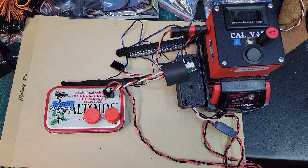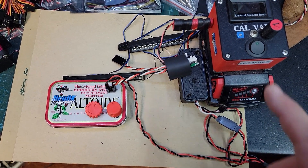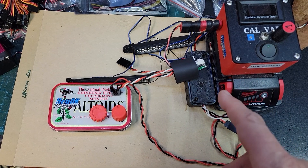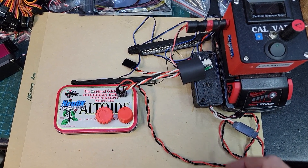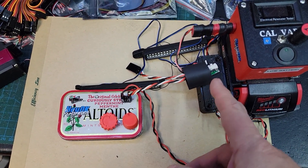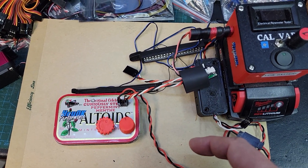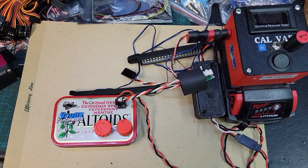Here's the new light controller, mostly working I think. This is a power supply, so it can be anything you want — it's got to be more than 12 volts. There's a regulator inside the circuit that I haven't quite finished yet, and it's going to keep the voltage to the lights at 12 volts to protect them.